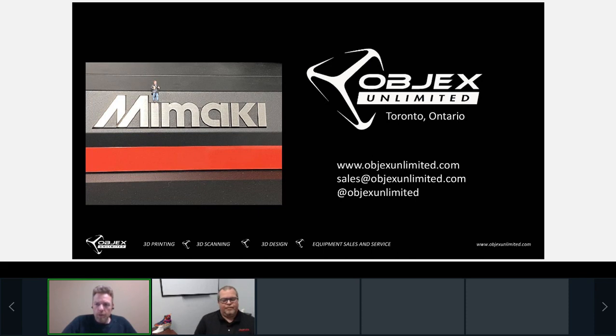And if you look at other machines and how much material you are dumping that you're not actually putting into the part, that has a big impact on per part cost also. There's no penalty for me to print one. So if I print one model and it takes me 3 hours, or I print 12 models and it takes me 3 hours and 12 minutes, there's no material cost difference from the 1 to the 12, because I'm not doing any flushing and I'm not making a verification strip. And that could be a pretty significant savings versus most of the other technologies that we deal with.